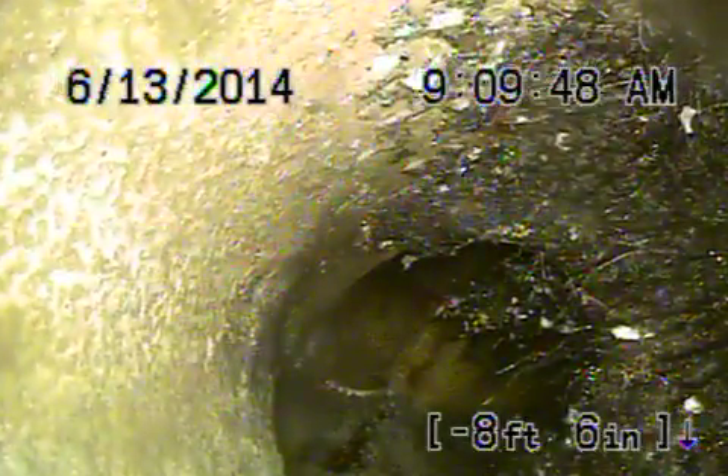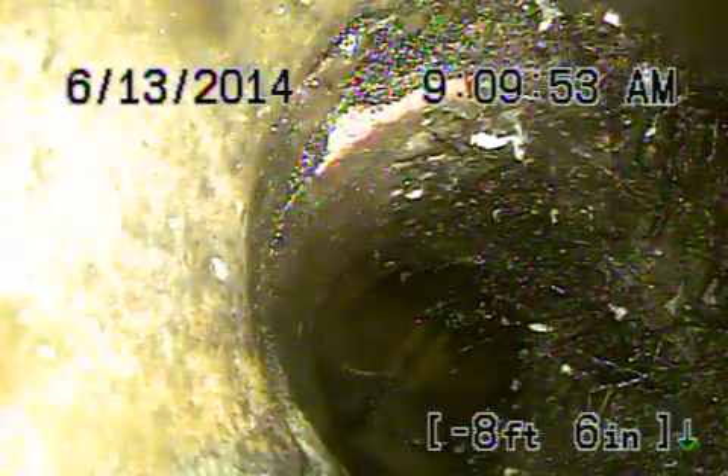This is going to be a section of 6-inch clay pipe, which is in pretty good condition. Then we transition to 4-inch. We're going to keep coming back and make a turn coming up. You're going to see some roots coming in through the joint right here. These roots can be cleaned out — I definitely recommend a Hydrojet just to blast it out and give it a good cleaning. You can see right there where the joint is, the roots are coming through that coupling.